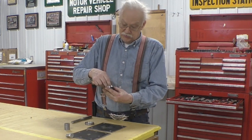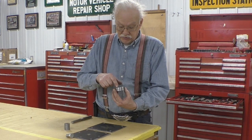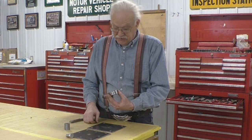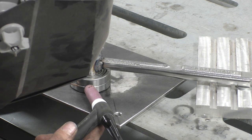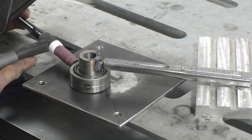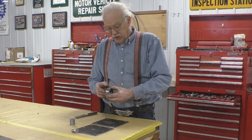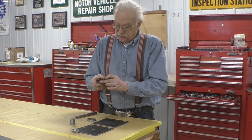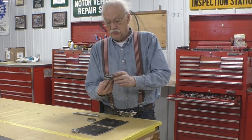If we were just to weld this to the ceiling it could cock, so I have another race here that we're going to set on top of this — and it fits beautifully just inside the race. There's a cage right there, and the race of this one fits just inside that race. Now this bearing is held in place, it won't rock. This hangs down; this bearing is a combo so the weight is hanging from the center. We took a piece of metal and ground it down so it just fits inside that bearing.